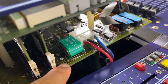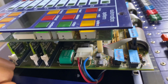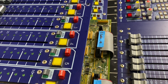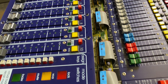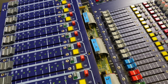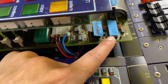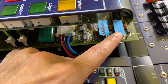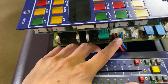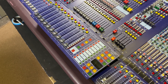The battery needs to be soldered — there are two points right there and then another one on the back. Here's what I did as far as the labeling goes: each of the ribbon cables I decided to call one through six, because there are six of them. I just have little arrows to make sure they're going left to right. There was also an unused socket right here, so I put a piece of spike tape on it just to confirm when I put this all back together that it's unused. This sixth one I'm assuming is the master power supply for the board. There's actually another ribbon cable underneath this, which I'll show you in the next video when we take this all apart.